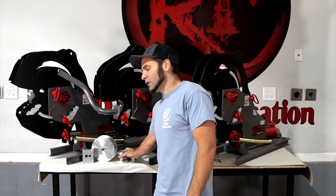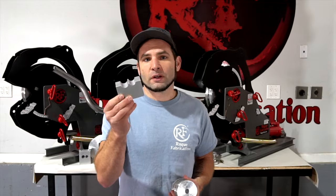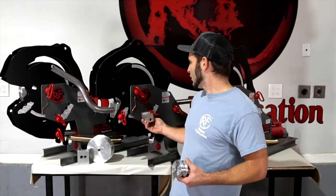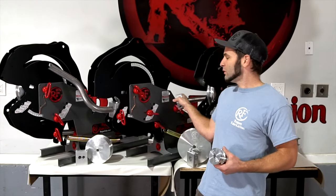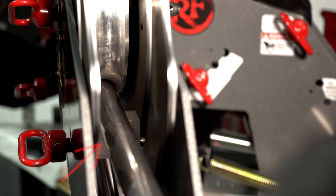After you choose your die, you'll get to choose the roller pressure die option if you want it. A friction pressure die looks like this — it sits in the machine on a pin and the tubing slides over it as it's pulled up and bent. This one is also a three-quarters seven-eighths combo pressure die and it's made of aluminum.